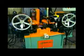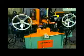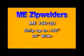For those applications where delivery is important, Guild now keeps four different frame sizes in stock. The first two are the ME 175-14 zip welder, which is designed to handle strip up to .175 inches thick and up to 14 inches wide, and the ME 150-20 zip welder, which is designed to handle strip up to .150 inches thick and up to 20 inches wide.